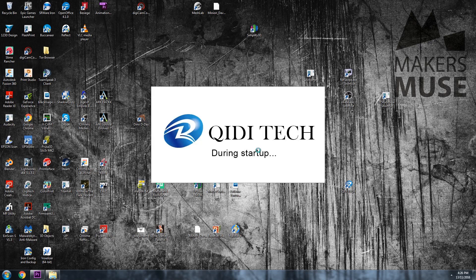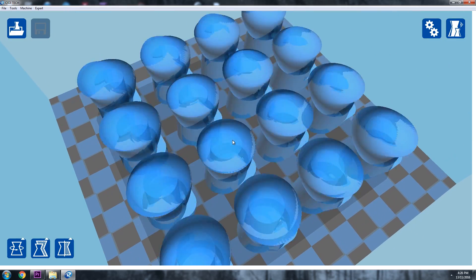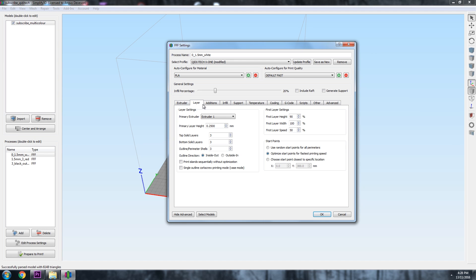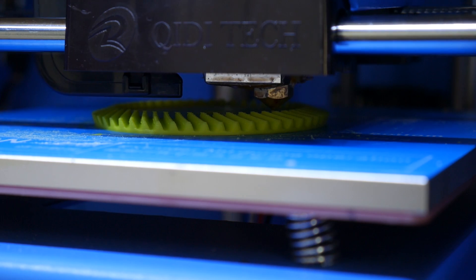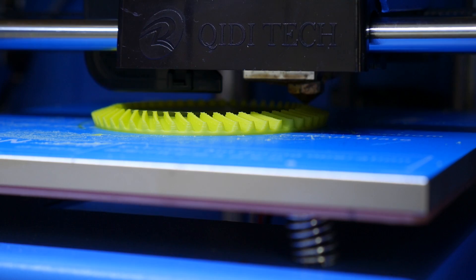The X1 is provided with their own software, which is essentially a rebrand of an older version of Cura, and I needed admin privileges to run it — yuck. So instead I just rejected that and went to Simplify3D, but there is no preset available within Simplify3D at this time. So I made my own, and to be honest, with a bit of trial and error, I got it really dialed in and I'm super happy with the results. I'll put a link in the description to where you can grab my profile, but expect Simplify3D to roll out their own very shortly.